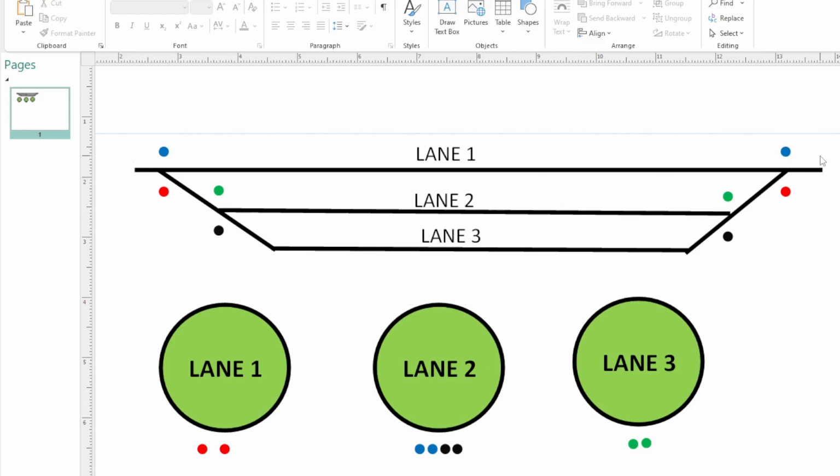If you want to use lane 1, that's fine. If you want to use lane 2, that's fine. If you want to use lane 3, then you have to have pressed lane 2 before it in order to open up this point on lane 1 here to get the tracks going this way. So using this method, you can carry on indefinitely and just keep adding lanes and lanes, and it works with push buttons as long as you are going sequentially.